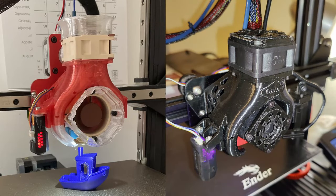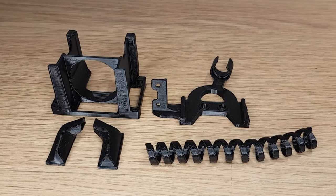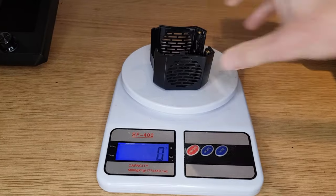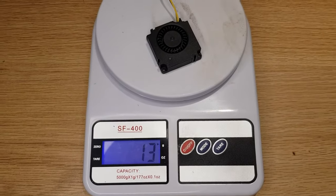Some designs, although looking spectacular, can do what they set out to do but at the cost of added weight. Not so with the Minimus cooler. Every gram added to your hotend is just more weight that the x-axis stepper motor has to get moving and also more inertia for it to stop. With print head movements starting and stopping thousands of times per print, even the smallest amount of extra weight can affect the quality of your prints. Paul has designed his cooler with weight saving in mind and has literally made it as minimal as possible, hence the name Minimus. I weighed the stock setup and the 3D printed parts, and even the largest 3D printed parts come out 15 grams lighter than the stock setup. The standard Creality fan that I add for the dual fan setup is only 13 grams, so even with an additional fan it still comes in lighter than the standard assembly.